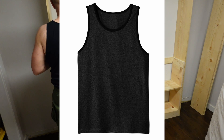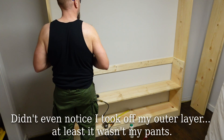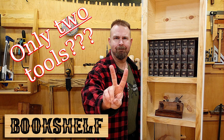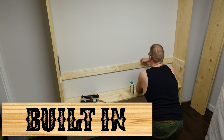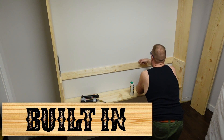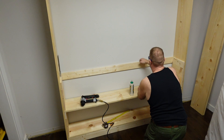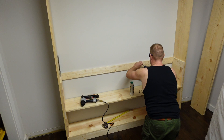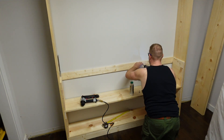Forgive the shirt — we had a pretty good fire going. Here are some ways to expand on my easy bookshelf idea. If you want to do built-in style shelves, you can save on materials by screwing thinner furring strips to the wall instead of using full-width 1 by 12 or whatnot. This will also give you a little more depth on books that aren't full height.